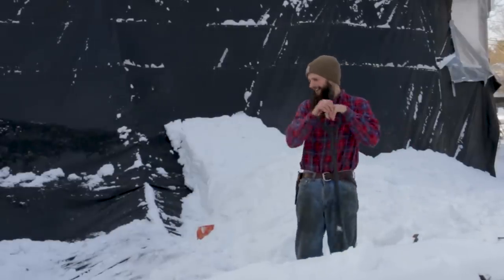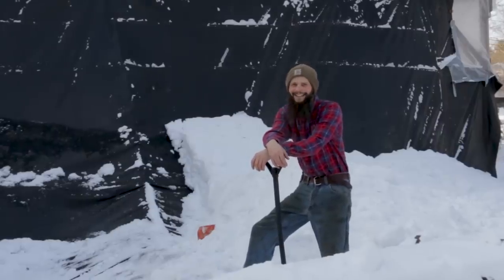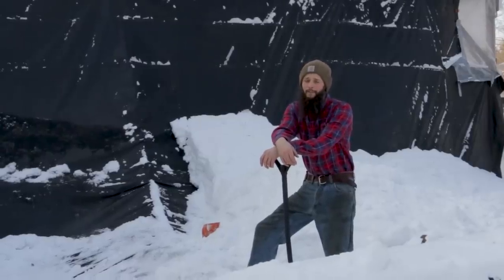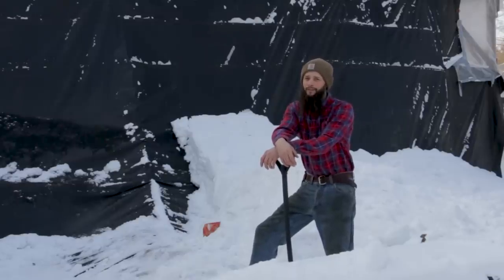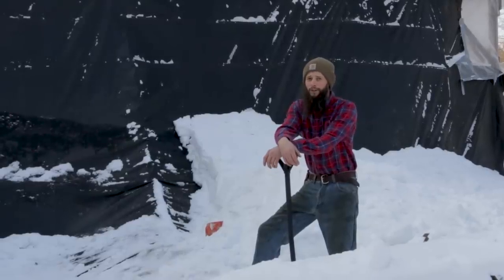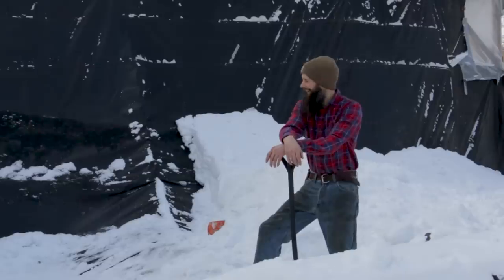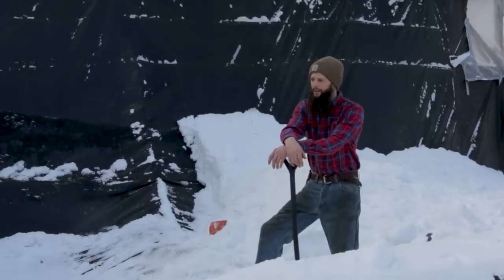What are you doing shoveling the backyard? I was bored — figured we don't have enough going on and I haven't been getting enough physical exercise. The weather is pulling a 180 on us. The last three weeks we've had a high of like 10 degrees, most days in the single digits. Now we're going to get into the 40s and even the low 50s. So the hope is we're really close to being ready to pour the keel. If we shovel the snow off and get a couple days of 40 and that day of 50 with rain, it might thaw enough that we can bury the mold and do the pour before it gets cold again. We've got like a week and a half window with two days of rain to work around, so we're going to bust hump and try our damnedest to get this done.